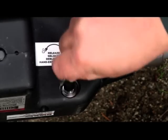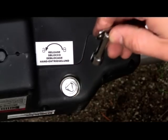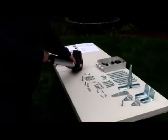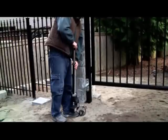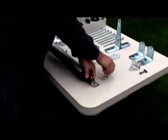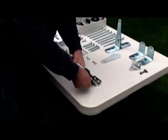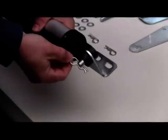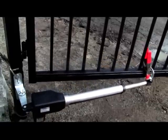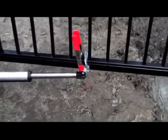Use the emergency release key to unlock the opener. You can stretch or retract the moving rod by hand to pull or push the gate. Now attach the post bracket assembly and the gate bracket to the ends of the opener arm using the clevis pins and hair clip pins. Secure the clevis pins with the hair clip pins. With the gate in its open position, hold the opener arm level and temporarily clamp the post bracket assembly to the gate post and gate bracket to the gate in their approximate positions.